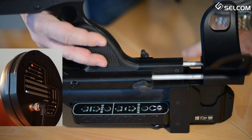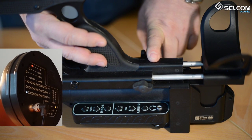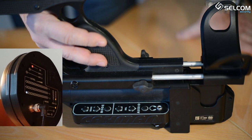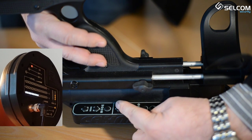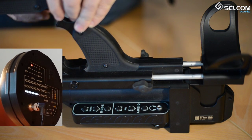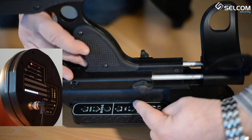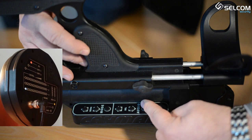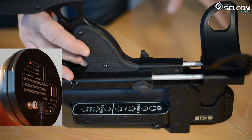Upon activation of audio mode, frequency combination 1 is set by default. It is meant for probing semiconductor content and as a rule gives good results in identifying active radio transmitting and sound recording devices. Frequency combination 2 is used to analyze return signals from metal oxide metal structures. The remaining 4 combinations are auxiliary, advised when responses have been observed in search modes on the red-level multi-segment gauge yet probing with combination 1 or 2 has rendered no definitive findings. The strength of the reflected signals for different scanning frequencies is shown on the display. Switching from audio mode to search mode is done by pressing the mode button.